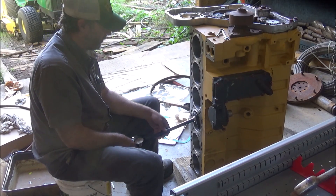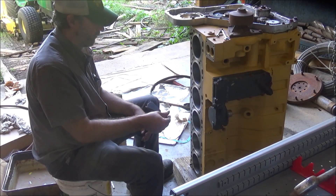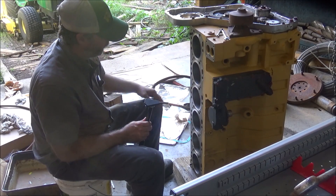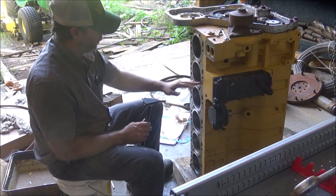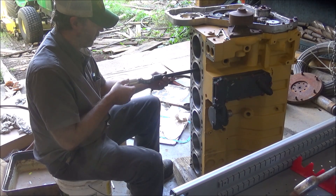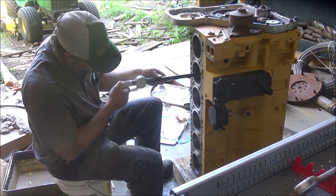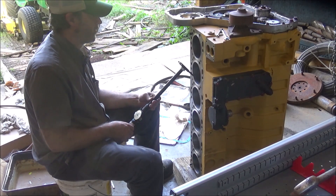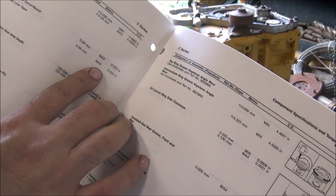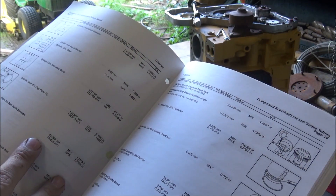They're all up in a thousandths and a half. Probably about a thousandths difference in around this. Out of round and taper is three and I'm checking at one, pretty much all of them. I'd say that's good to go.